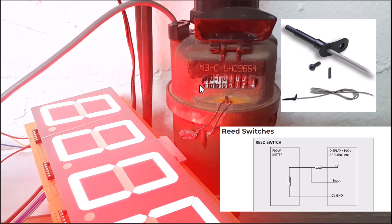...have a small paddle, almost like a rotating turbine, that has a magnet attached to it, because the reed switch is magnetic-based. So every time the water flows, the reed switch will open and close, and that action of opening and closing will induce pulses on the outside as you connect it to your microcontroller.